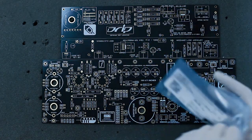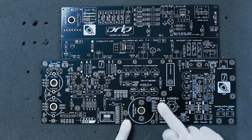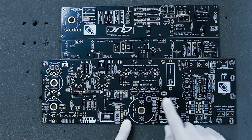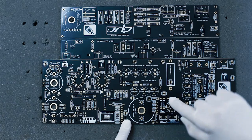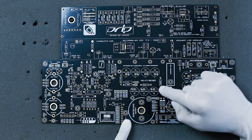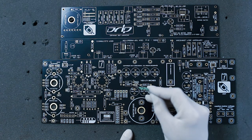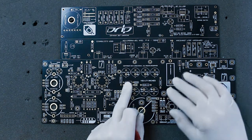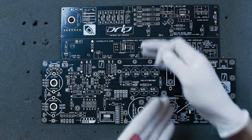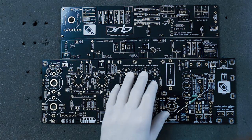The first bag is 500 ohms — those go in the power supply. The high voltage either goes through the diodes or the 6x4 rectifier tube, then through the 470 ohm — you can use a 500 — and then a Hammond 155G choke. It goes to the next 500 ohm. The path splits to the 2.2K and the 500 ohm, creating capacitor banks. You can reference the EQP-1A schematic if in doubt.